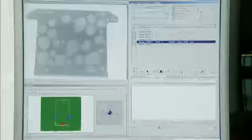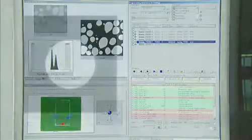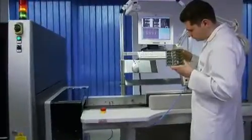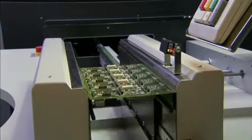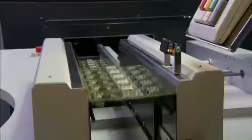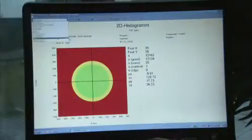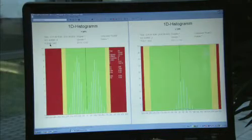The x-ray analyses from VISCOM assure fast automatic defect recognition, whether it be THT analysis, void inspection or 3D BGA inspection. The effective VISCOM repair station with colored overview image allows defect verification to keep up with line speed. Available good-bad images assist the operator during defect evaluation and support zero defect strategy. With the statistical process control from VISCOM called VPC, numerous filter functions are available for in-house process evaluation even from a remote computer.